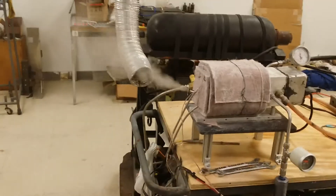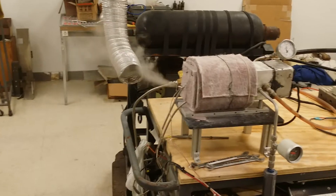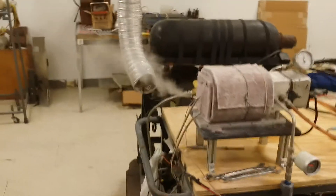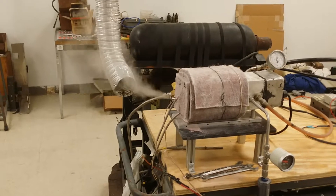So you see some water — you get some condensation. That's Joule-Thomson cooling. This is going from 1500 PSI to atmosphere pressure, so it's like an expansion valve in an air conditioner.